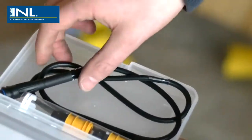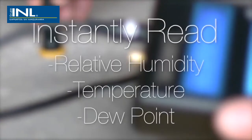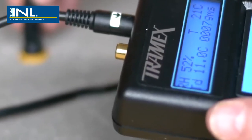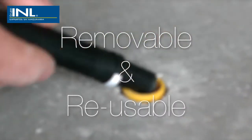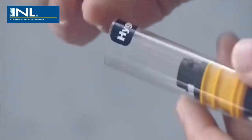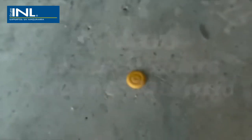When taking readings, plug the interface into the HygroEye probe and instantly read the relative humidity, temperature, and dew point simultaneously on the clear display. When testing is complete, the HygroEye probes can be removed with the extraction tool and used repeatedly. The user must be mindful of all proper safety precautions as mentioned in the ASTM standard.